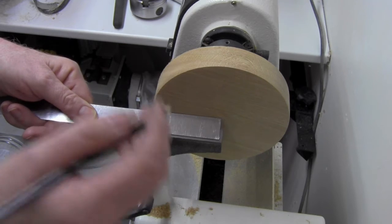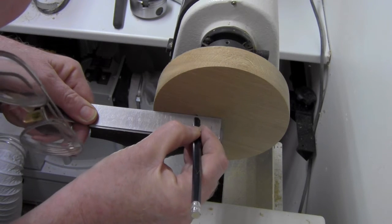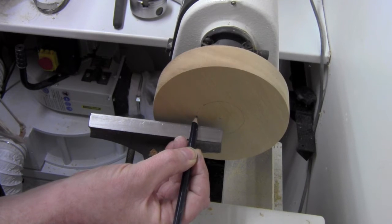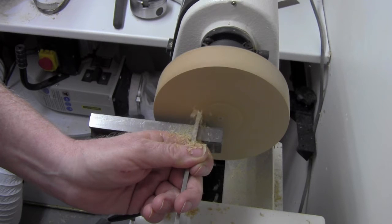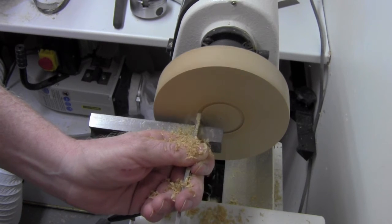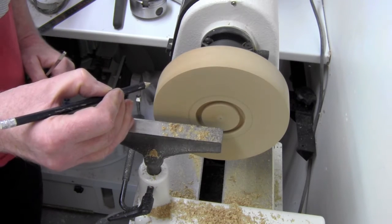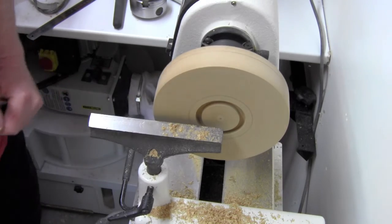My Nova 3 chuck later on, so I need a 2-inch mortise in the centre. This will become the bottom of the bowl when it's finished. Putting the guidelines on the blank will help me see the start and finish of where I want the curve to be.